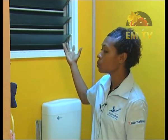No. After we have washed the walls with water and bleach, we must then wash the walls down with clean water to clean away any film that may be left behind by the bleach and water, and then let it dry before we come back and paint. So what can we do to stop the mold from coming back? Ventilation always helps with preventing mold.